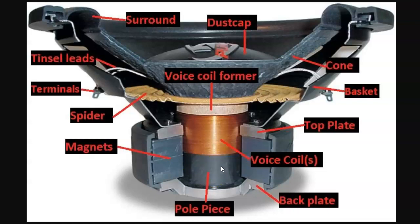We talked a lot about how heat is wicked away from the voice coil. The gap — which is between this top plate and the pole piece — is where the voice coil sits. You can see the voice coil isn't quite centered, and it's not supposed to be. Where the top plate and the pole piece meet across that little air bridge right there — that is the gap.